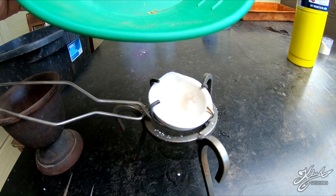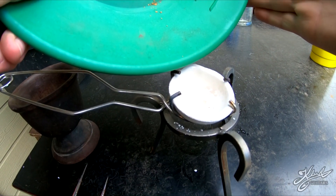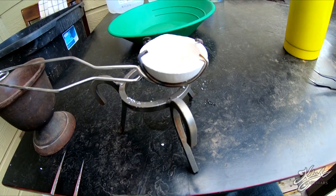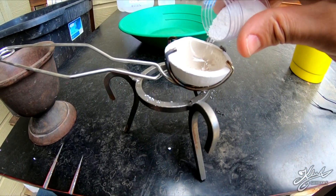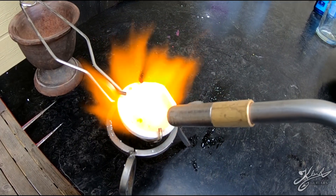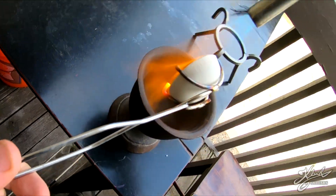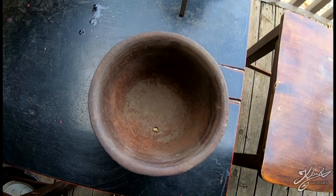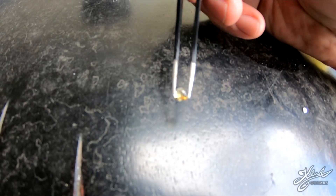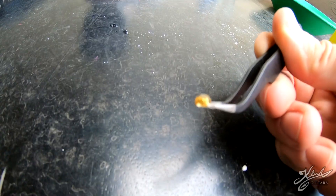We have our preheated crucible with some borax lining it. We're just going to take this gold and pour it right in there without losing any. We'll add a bit more borax and heat it up. We have our gold poured off into this metal cup — it's in a little bead of glass. You can see the gold on the end of this glass bead. Now we just have to break it out — basically just smash it and pan it.